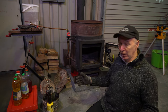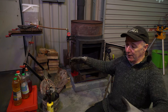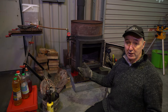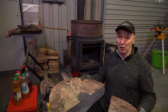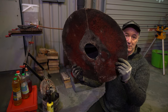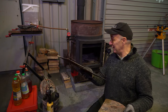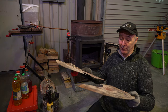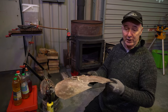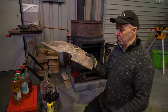To make this work as a waste oil burning stove, what I have to do for my design at least is plate off the bottom. I'm going to make all the air for combustion come through a hole - a small hole, maybe four inches in diameter - and come up from the bottom. Using what you have around the place, this is no big science project. This used to be the lid off one of these oil drums. I drilled a hole and cut it in half. The reason I cut it in half is so I could actually get it in through that door.